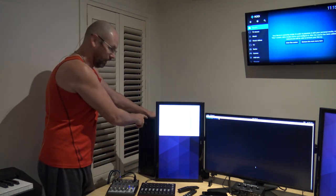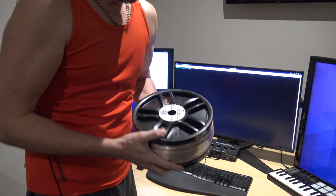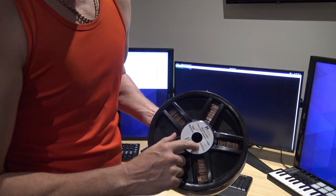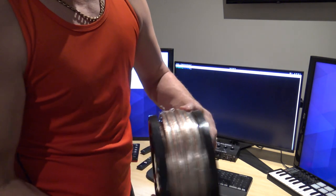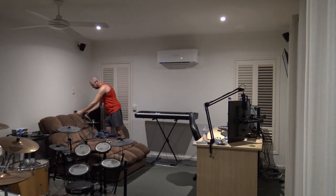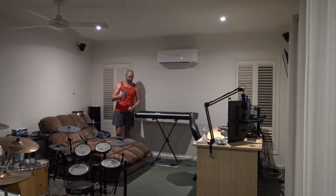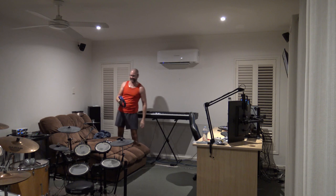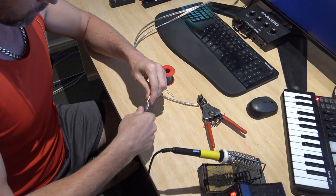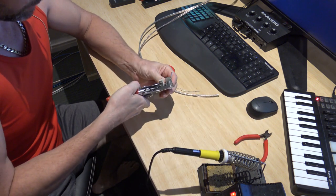I've decided I want the amp over this end, and I'll make a bit of room next to the monitor — I'll put it on its side but that'll do. I'll run the speaker cables around the room to the speakers. I've got some pretty chunky speaker cable here — 16 gauge, 100 meters. It'll go from the amp to that speaker, and another run to the other speaker. Today I even got a tambourine. What I like to do with the cables is just solder the ends so you don't get the strands fraying everywhere.